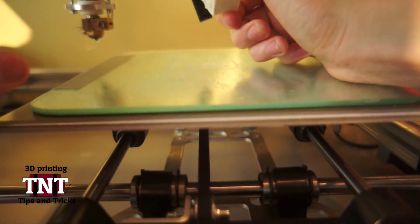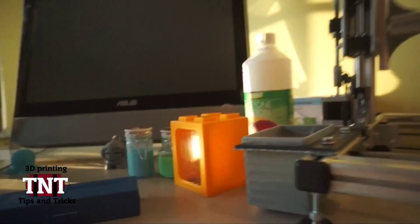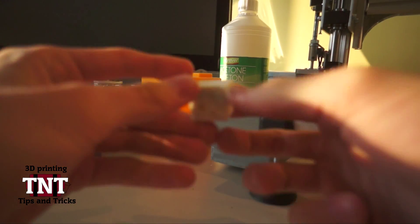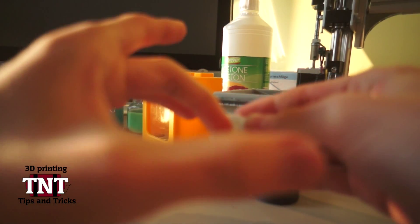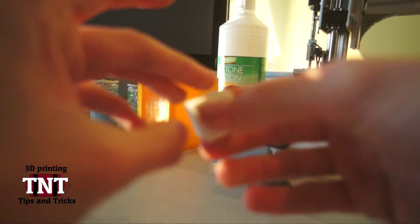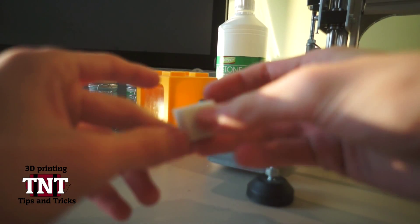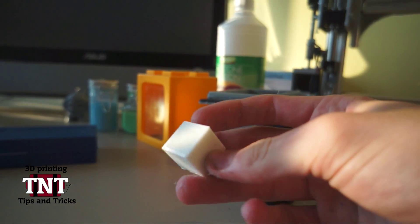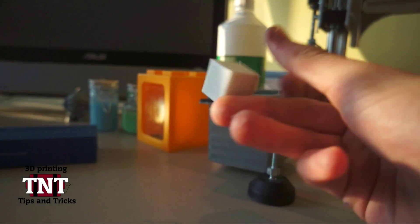Make sure to calibrate your printer. After you remove the part you can look underneath to see if there's any juice color on it. It prints really well, and even bigger parts won't warp at all. The bottom was a little bit dirty because the nozzle wasn't 100% clean when I used the white ABS — it had some transparent ABS as well — but it was a really great print and it stuck really well. After about 5 layers it will usually come off the print bed if something is wrong. If you want to know the perfect amount, just experiment a little bit for yourself.